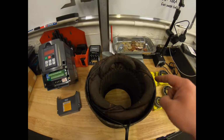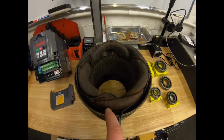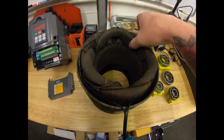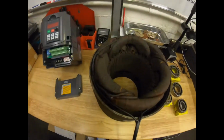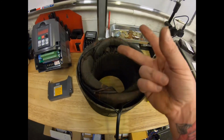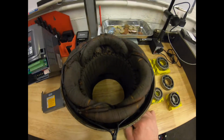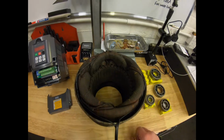When you take the motor out and you find the windings, there's three wires coming out of here, which is your three phases. Now, if you're lucky, you can pull apart the strings that are attached in here that are normally brittle and broken up, and you can find the star point of this motor where the other end of the three phases are all joined as one, which is called the star. Now if you can find that and you can pull it apart, then you can open them up and separate them, and now you'll have six wires.